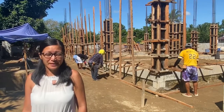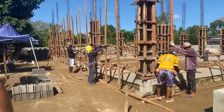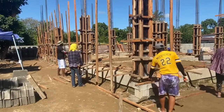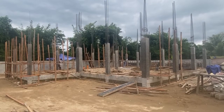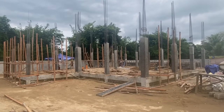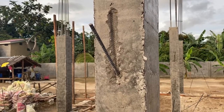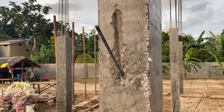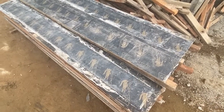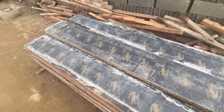As you can see, they're all busy making the scaffolding for the tie beam. A nice overview of all the columns which are erected now. The last box is going off. This is how the horizontal bar is coming out and they don't damage the box. The gap in the column will be filled up later when we do the hollow blocks for the wall. The boxing is completely undamaged so we can use them again for the columns on the second floor.